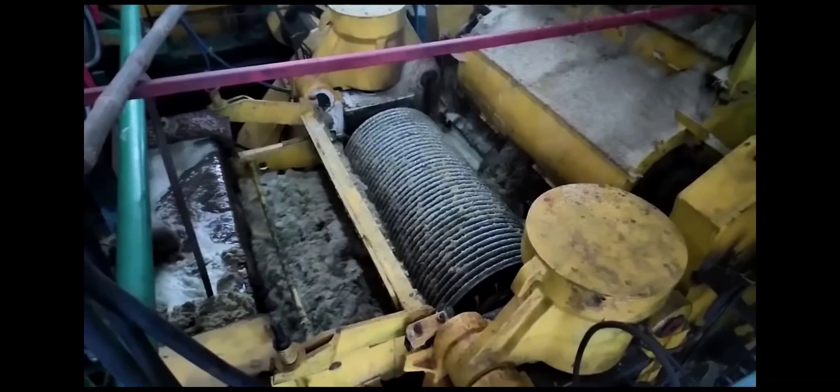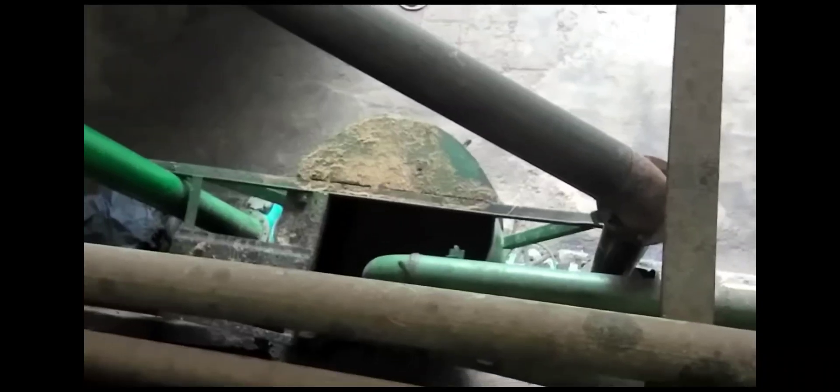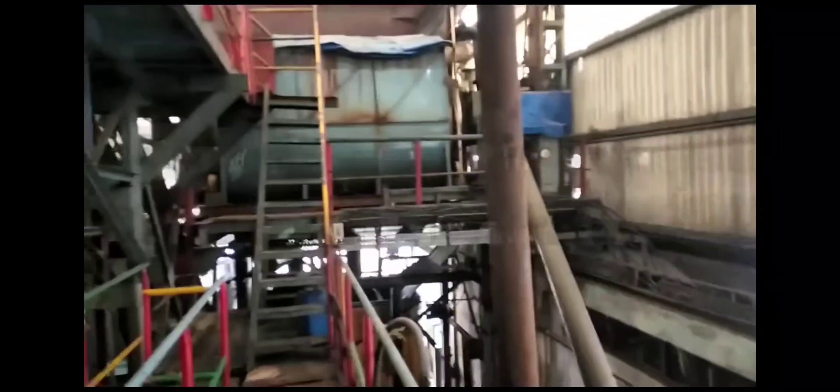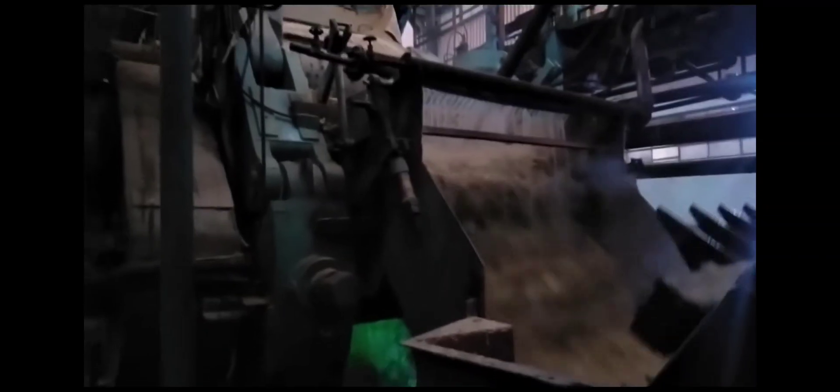As you can see, this is the juice extracting process. Extracted juice from the first mill and second mill is collected together in one place and dropped into the bottom tank, which lifts it up to the storage tank. Hot water is added at the discharge of the fourth mill for extracting maximum sugar juice from the bagasse.